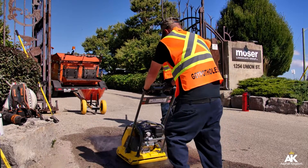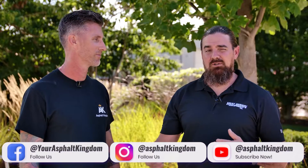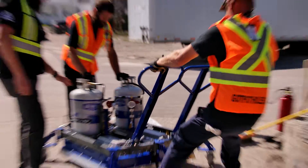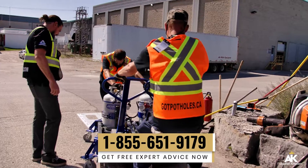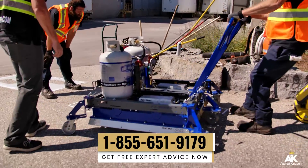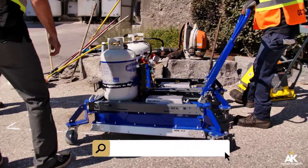Once you're satisfied with the compaction, leave it and pile it off. You're going to leave it for up to two hours. You can let light traffic drive on it after about 20 to 30 minutes, but in order to maintain the structure of the patch, you want to leave it off to traffic for about two hours. While you're compacting that first patch, you're going to move your heater over to your second patch and continually move on — that's how you increase your productivity, constantly moving that heater while you're compacting the asphalt.